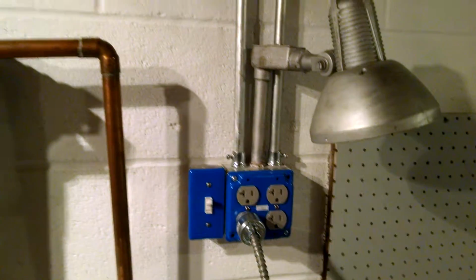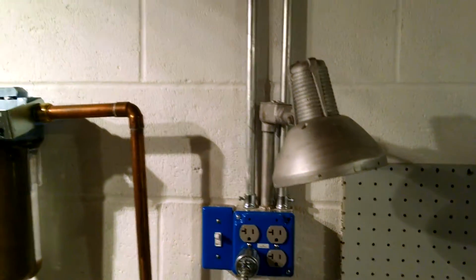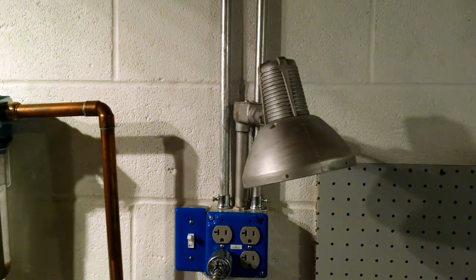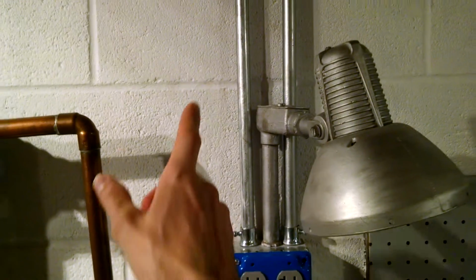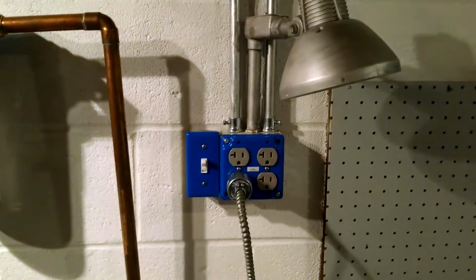But in this case, there's a separate set of lights in this. By the time you're in this part of the basement, you're going to be on that separate set of lights anyways. And I did the same thing, 1/2 inch EMT, and same thing, got to put a clamp here probably, and anti-short bushings, just to give it some protection against chafing.